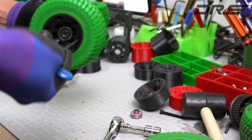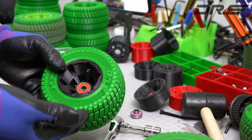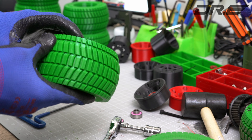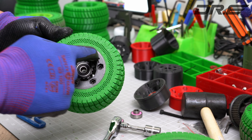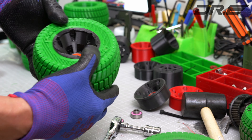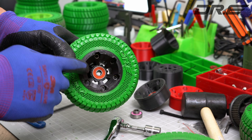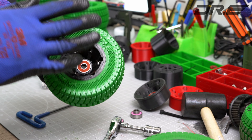Because these are using M5 nuts and screws, they're very strong. I'm also using ABS — these will never break apart, so long as you print the TPU well. Check the layer adhesion and perimeters here — mine are good. This wheel is nearly perfect. You should have six screws on the inner side — it should say 'Dr. E Inner V1'. On the outside it should say 'Dr. E Outer 70 V1'. If you're using other wheel sizes it will say 'Outer' followed by the size number and version. The nuts are on the outside so we can see right away if any nuts get loose.